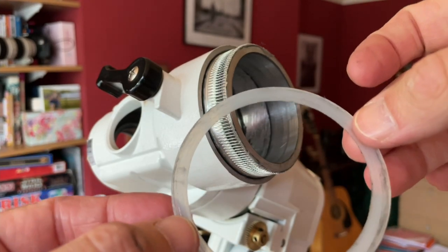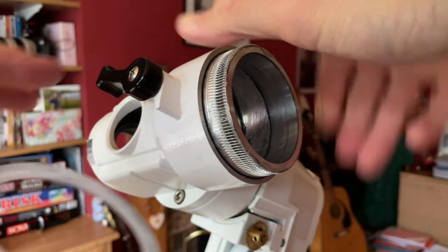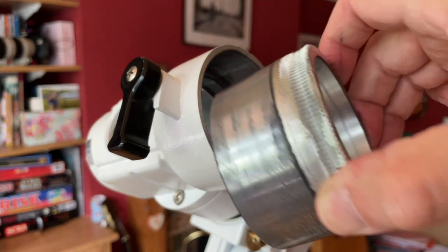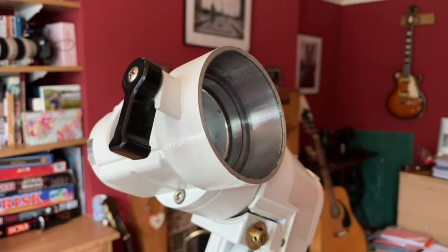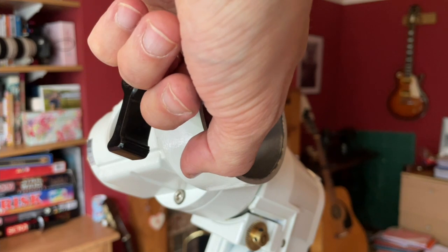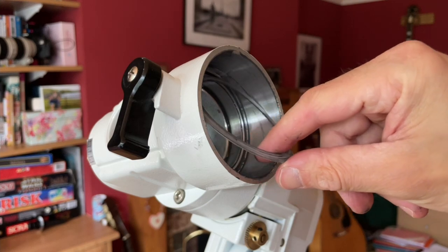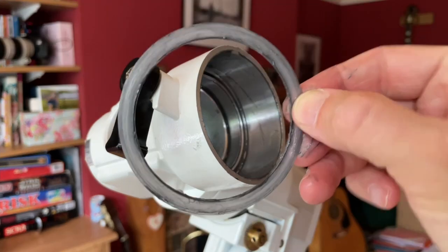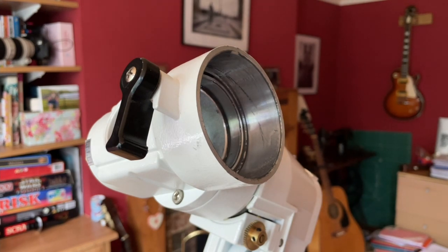You've got these nylon washers as well — you need to check those, make sure that they're not damaged in any way. Keep hold of them and keep hold of the order that they come out in as well, so you'll have one nylon washer either side of that worm drive gearing. Just make sure that you keep all of these pieces in the order that you take them out so that you can clean them up, re-grease them, and put them back in the same order. Removing that second nylon washer — mine seemed to be pretty stuck in there, but that's now removed. As you can see, this nylon washer is in pretty good condition, it's not broken or damaged in any way so we can reuse that.